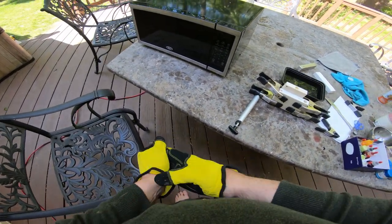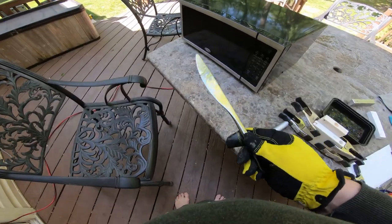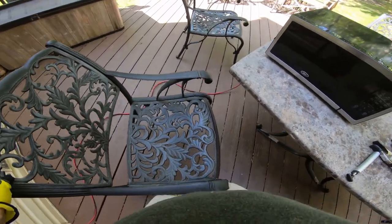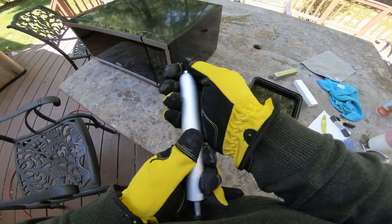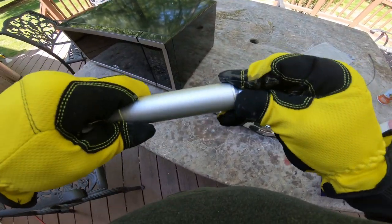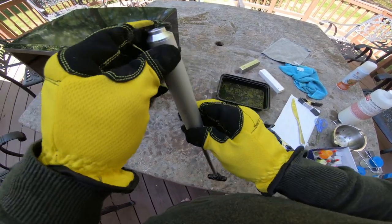Cook the plastisol for about two and a half to three minutes, stirring in between as it comes along, slowly getting it back into a liquid state. For a stirring device you can just use a kitchen butter knife. You want to make sure all your apparatuses are clean — make sure all the edges and everything is free of debris, nothing gets clogged. This injection squirter syringe isn't very big but I'm only doing a couple at a time, so I don't want to get too carried away.